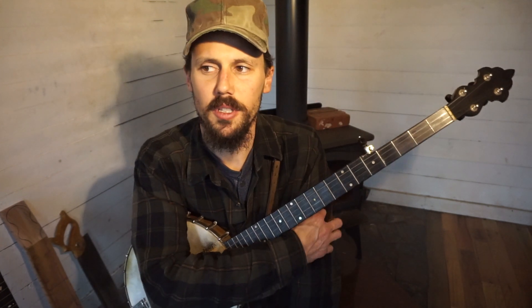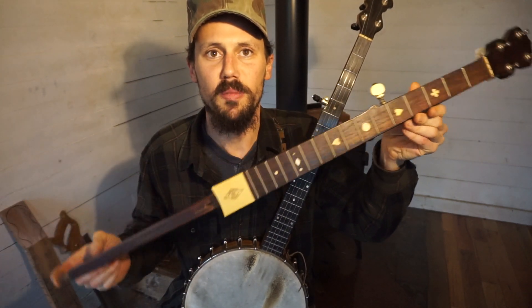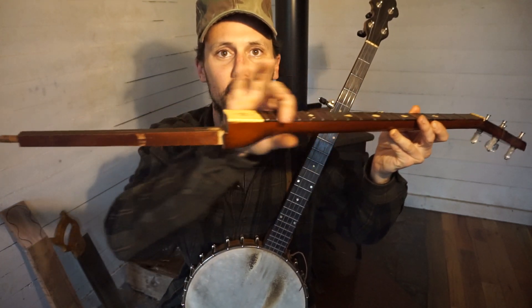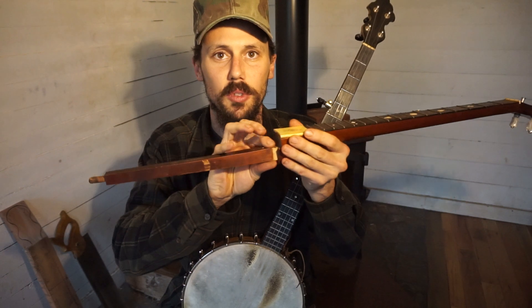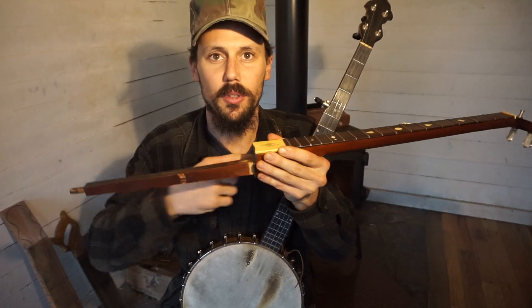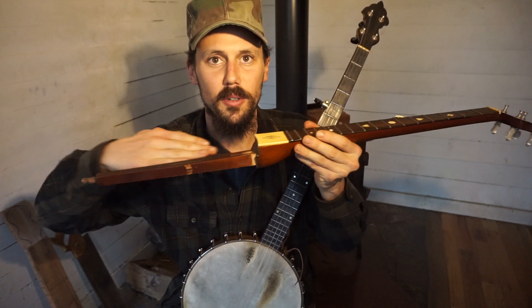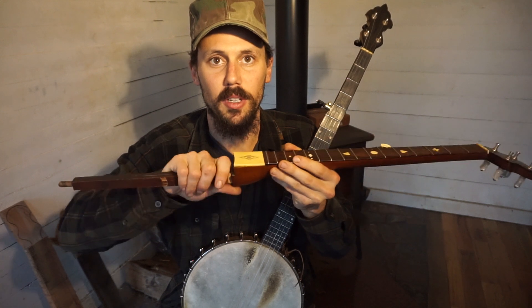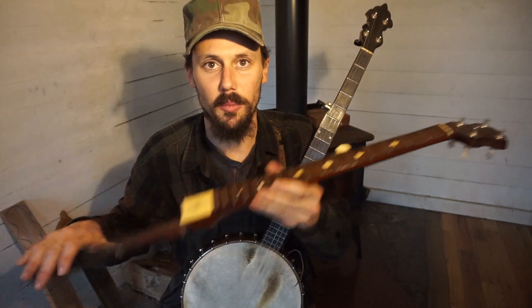I've found it out by figuring it out for myself. So how is neck angle achieved on a factory-made banjo? Here's an example — an antique factory-made banjo neck. This is not one solid piece of wood like the casual observer would guess. This is one piece of wood, and then this is what they call the dowel — a separate piece of wood. There's a mortise in here, and this has a little tenon on the end that goes into that mortise, sockets in there at the optimum angle, and it's glued and set in place. That's how most of these older factory-made banjos were made.